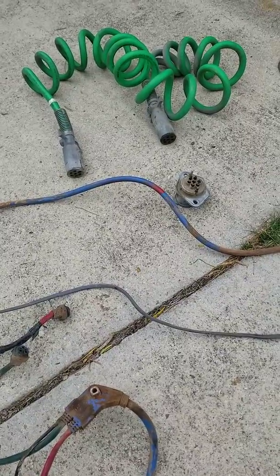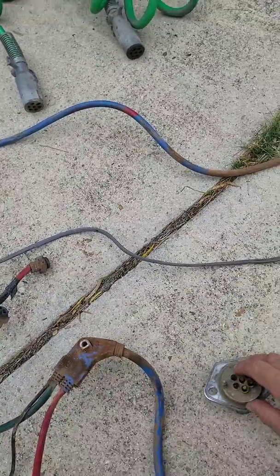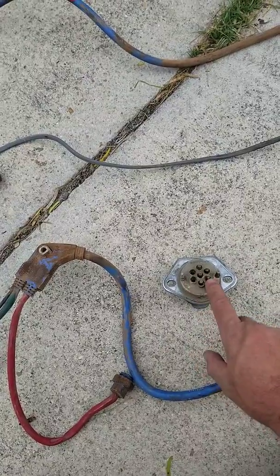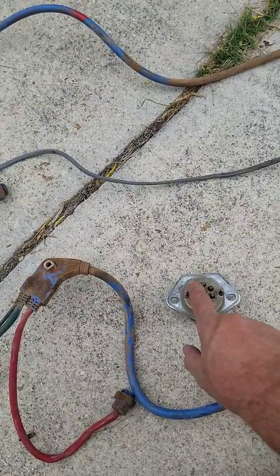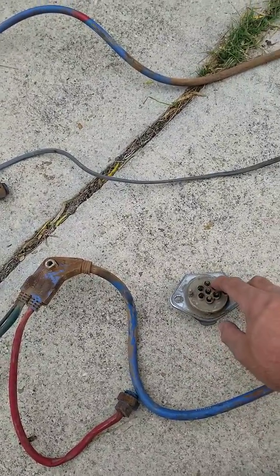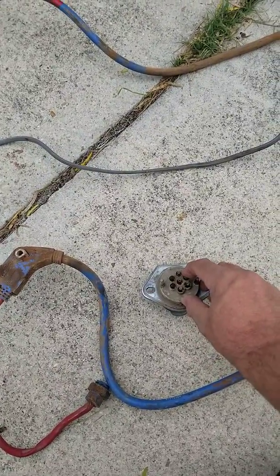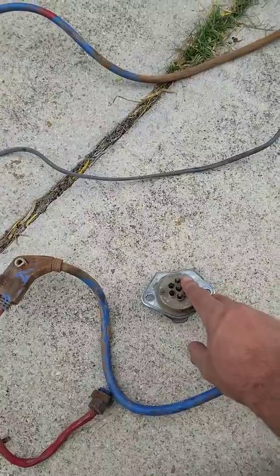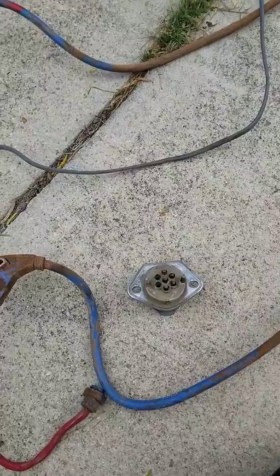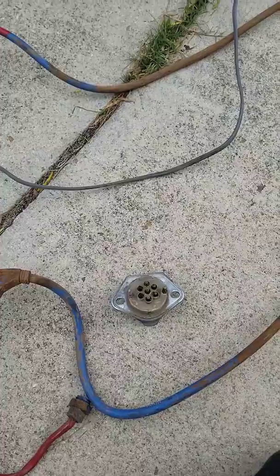And what happened is I went to this, okay, this is your ground. This is your ground, and this right here, this is your left, your right, your stop, your ABS, and this is your auxiliary lights, okay? So your marker lights. So I went to this marker light, and I checked it, and I had positive power coming out. So then I went to the light, and I had positive power at the light. So then I did some voltage drop testing. Well, guess what we found out? We weren't getting ground to the lights. So why don't we have ground?